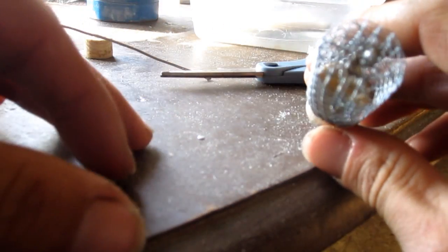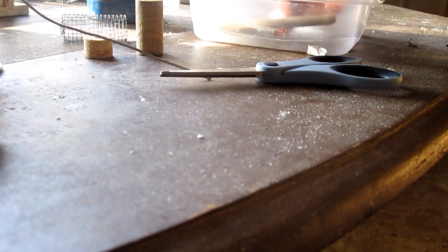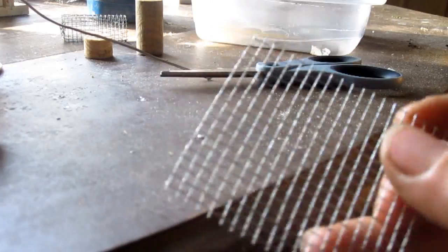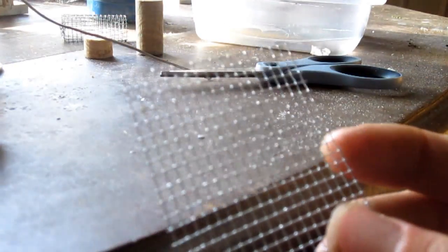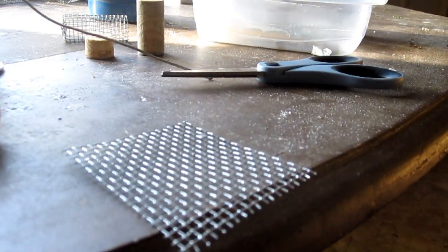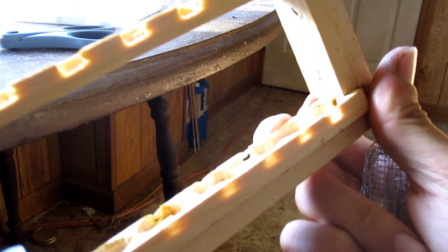Now let's see, what am I forgetting? I guess anything. The solder doesn't really adhere to this so much as the little drop of it will melt around it and then just hold it together. It's hard to get lead to stick to zinc galvanizing. It works. So I got a stack of them pre-cut, and you have to work out your measurements. I can't remember exactly the square count on those, but it works out so that make them like that.